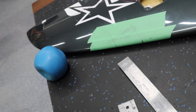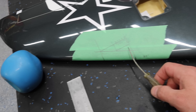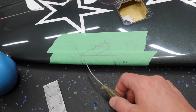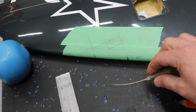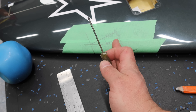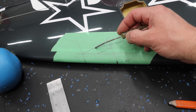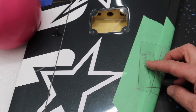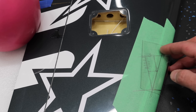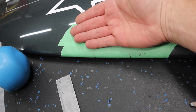We've flipped the wings over, got them all squared off just like we did on the top side, repeated everything to get our baseline done — we drew our straight lines again and drew our line with the carpenter's pencil, so that's all matching exactly the same. One thing to remember is our lights need to be facing forward, not at this angle. On the top side we're going to do one cut, on the underside we're going to do another cut here. What that does is give us two different steps, because we've got two separate lights, and then our lens itself will cover that entire step.